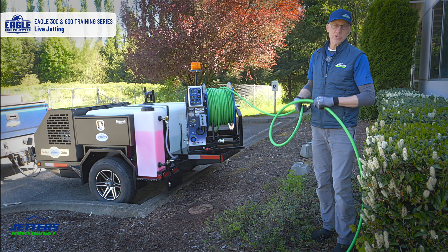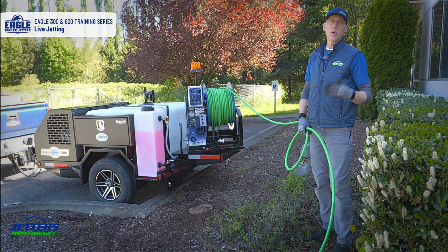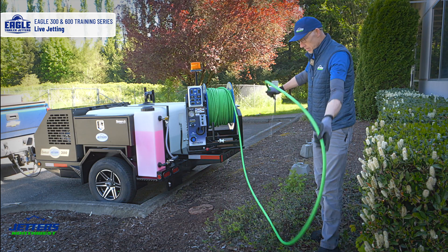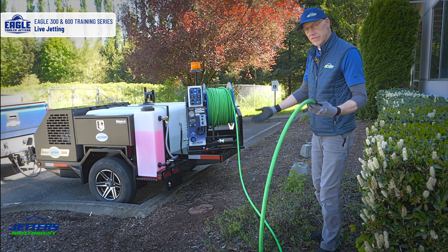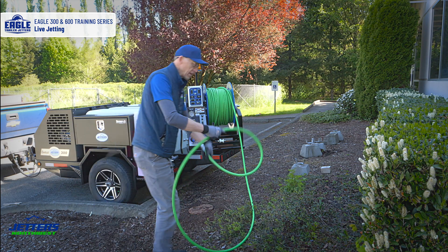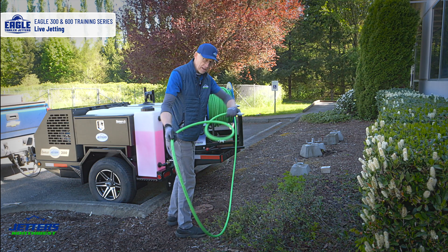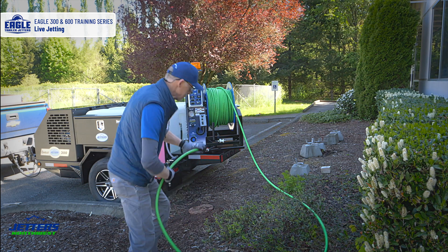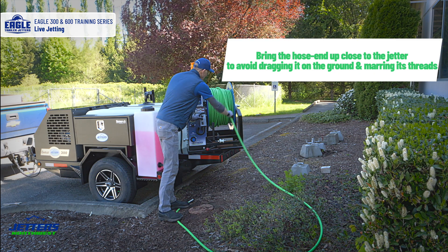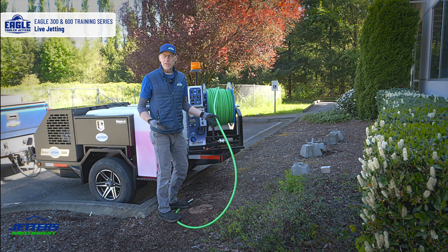With your wireless remote control you'll sometimes be working on the roof, away from the jetter. A lot of times you'll be jetting well away from the machine and you're going to stretch out a lot of hose. When you're winding that hose up, whether it's 20, 50, 100, or 200 feet, I like to lay it out in a nice big loop. This avoids a curling problem — if I have my back to the hose and I'm winding up and it catches on something with a curl, it's going to kink. So just stretch it out in a nice big loop, stand on the end, and wind it up keeping it in a nice controlled big loop. That way I don't have kinking problems.